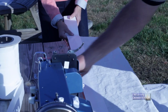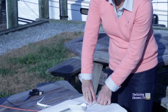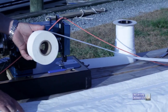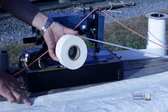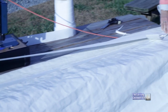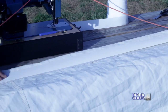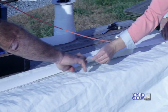Using the edge of a pair of scissors, we'll rub it down good and hard into the cloth. Because the tape is adhesive and I don't want it interfering with the leech line, I'm taking the sail tape and I'm going to run it on the backside to pick up the adhesive. This is also going to help improve the repair by stabilizing this torn piece of cloth a little bit further. So I'm going to bring this all the way back, get it nice and taut on this end, and then have my assistant reach across and hand me the tape.